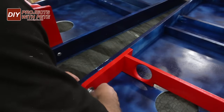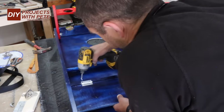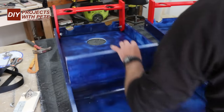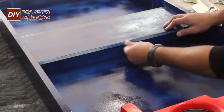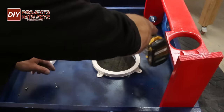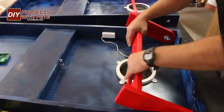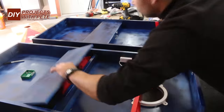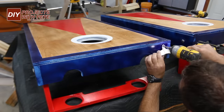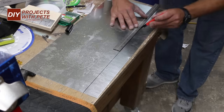Let the boards dry and then begin to reassemble them. I used some small two inch hinges and then an i-hook latch to hold the compartment area shut. Next up was reinstalling the LED light — use some short screws to attach it and then the battery compartment with a switch on it sticks to the side with some mounting tape. There's plenty of room for four bags in each compartment and a couple accessories if needed. This was my prototype of the back with the latch, the bottle opener, and a way to keep score. The scorekeeper is just a strip of 26 gauge steel I cut with tin snips and then magnets I picked up at the hardware store.